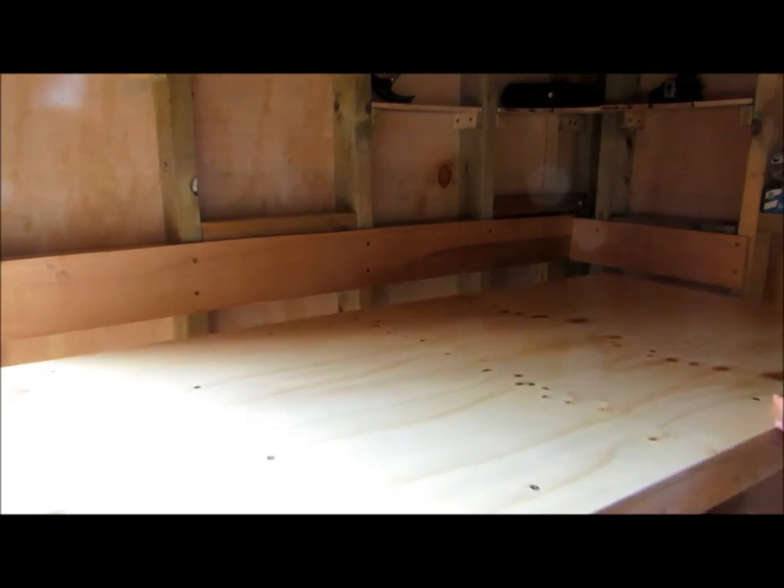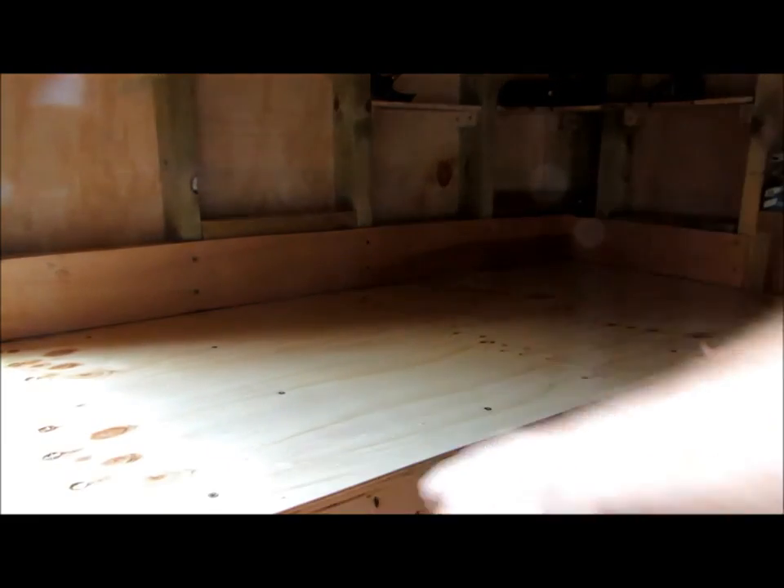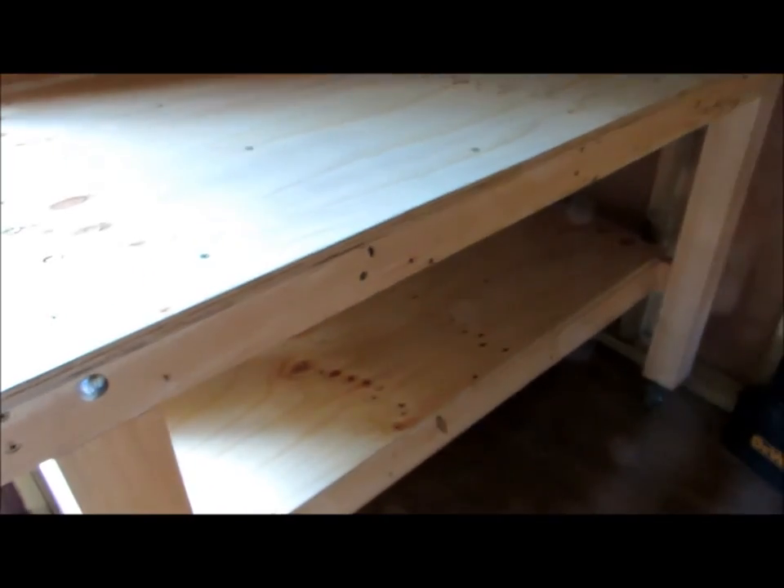What I have done here is put up some plywood around here - I measured it very carefully so this slots in just nicely. Unfortunately the lighting here is not brilliant - there is no lighting. So there's a slight gap just around the edge, and what I did was before I put this up I just got some playing cards - you can get very fine gradients of height - I think I used seven cards dotted along, thinking about the height I want. After I put the varnish on there is a gap there; I want it to slide under that lip nice and easily but with hardly any gap. So with the cards propping that up, just put that on, screw it into the studs, put the varnish on the top of that as well. So we now have a lovely sturdy worktop, shelf underneath, all on wheels.